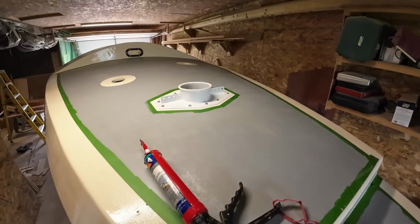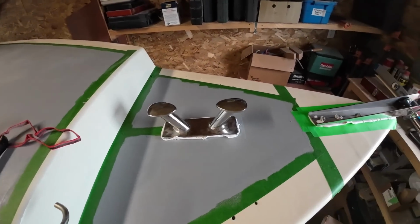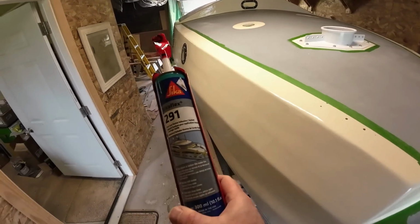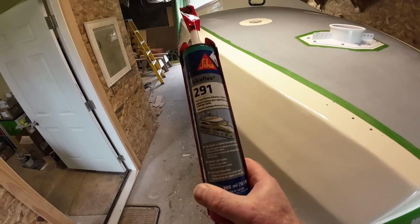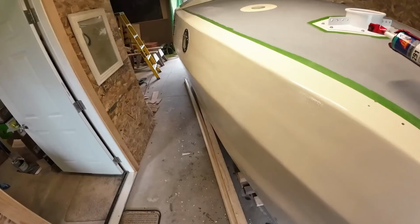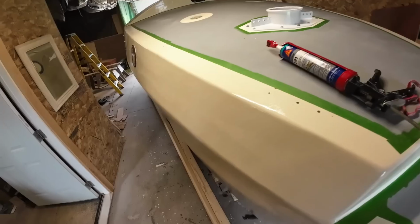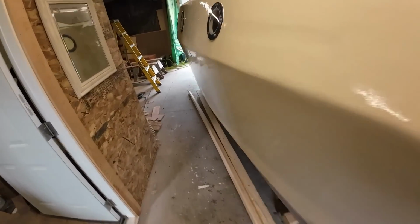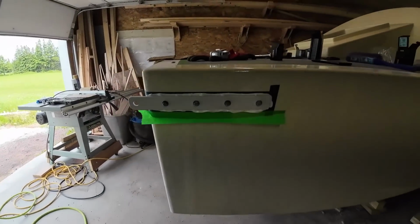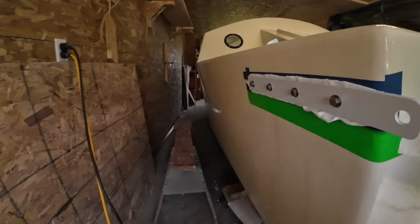Now, using the same technique of bedding as I did with the ports, I've done the mast partner, the anchor bit, and the anchor roller. I'm using this product now. It's Sika 291 Fast Cure Marine Adhesive Sealant, and it's good for above or below the waterline. I just went with Sikaflex because that's what I've used in the past. They're not sponsoring this video or any such thing. I also use the same product to install the drogue chain plates. So you can see there and over on the port side.